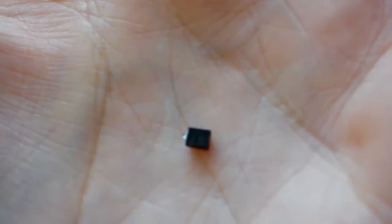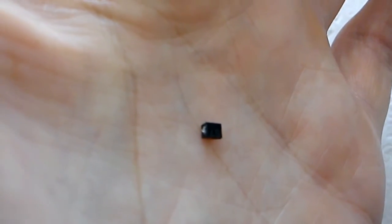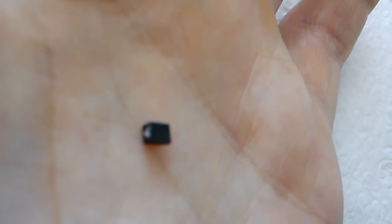So here's the little fuse — the little bastard fuse right here. I'm hoping this is the problem. I just kind of broke it out of there with a needle, and I'm going to try to re-solder it. I'm going to break the one out of my spare board and re-solder it. I haven't really soldered much before, and my soldering iron is the cheapest.